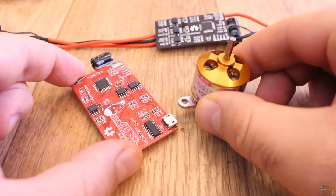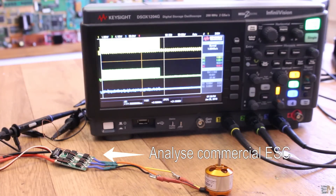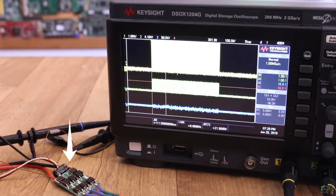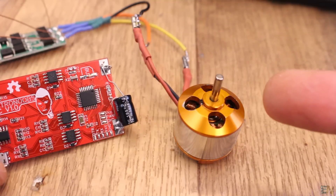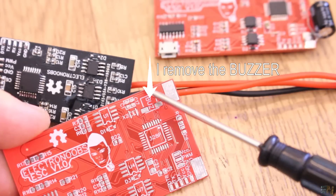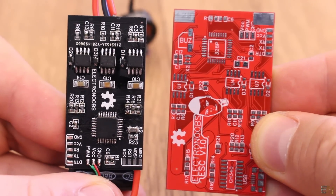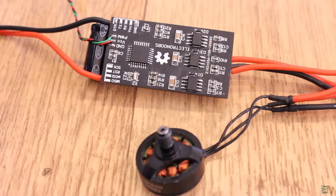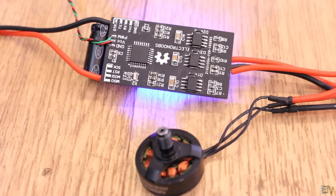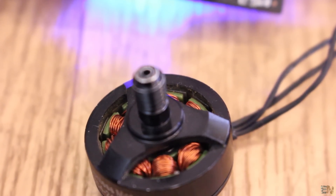In the past version I wasn't able to make the brushless motor beep because I was using the wrong signals. I've analyzed the beeping signal from a commercial ESC and applied that to my own code. In this way we don't need the buzzer or the signal LED anymore that the old PCB had. In order to control or program the ESC you need some sort of notification signal, so I'm using the motor as a speaker, allowing for a smaller PCB.